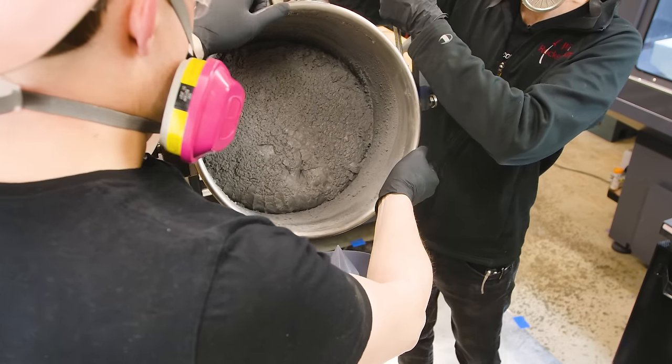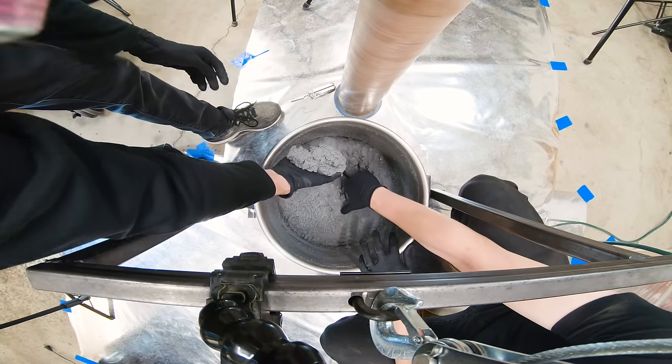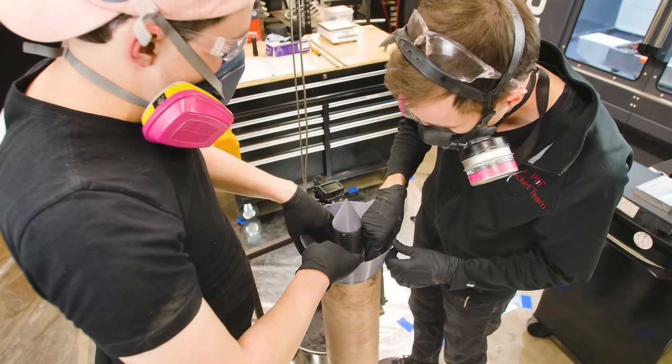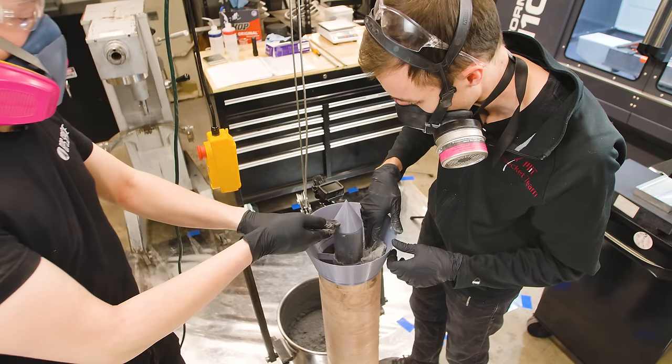The MDI was working quickly to harden the propellant, so instead of pouring it, we lowered the bowl to the ground, started grabbing chunks with our hands, and putting it in the tube manually. Quick sidebar about casting prep: we're putting this propellant directly into the liner of the rocket motor, though often people load propellant into casting tubes first. The liner is an 1/8-inch wall tube with an outer diameter of 5.75 inches, which should fit right into an 1/8-inch wall case with an inner diameter of 5.75 inches.